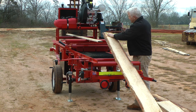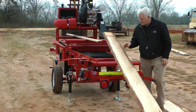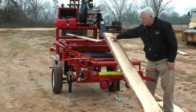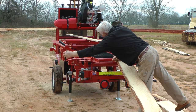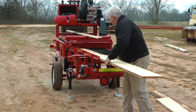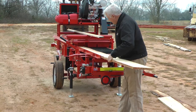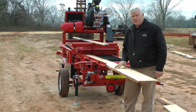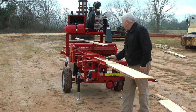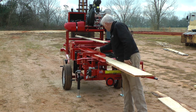I can take a quick glance and see that with a little fudge and a little bark, I can get a six-inch board out of this. I'll set this fence at one and three-quarters, lay the board up, push it against the fence — because of my relatively straight edge, I send it through and get a straight piece of lumber. That's what I like about this guide.